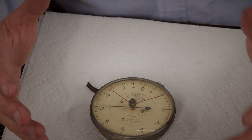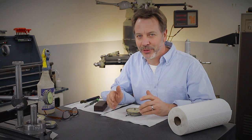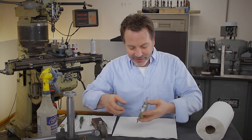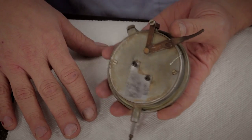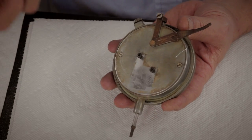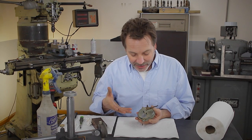What I'm going to do with it is clean it with mineral spirits, or what other people would call paint thinner. Paint thinner is one of my favorite ways of cleaning gunk off of anything that has oil in it. And this gauge here — all this brown stuff, the reddish brown — that's all just caked-on oil. That will come off with paint thinner.